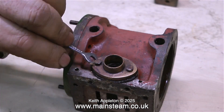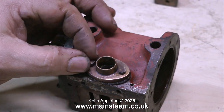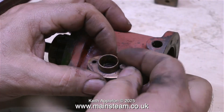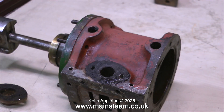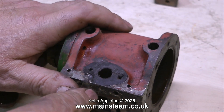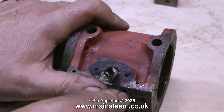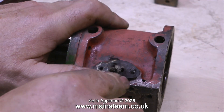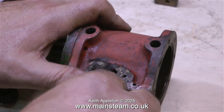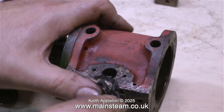In this clip I'm removing the next-to-useless exhaust manifold — I don't quite get this, it's just a very large orifice. The part isn't threaded, so I don't know what the plan was with this engine or how the pipe fitted to it. What I'm going to do is plug up the hole, then silver solder a piece of phosphor bronze into the large opening and thread it half-inch by 32 threads per inch, so I will be able to screw in an exhaust pipe fitting.